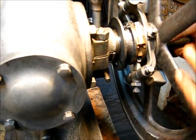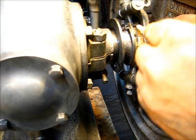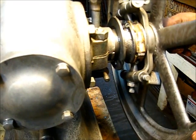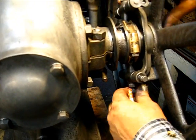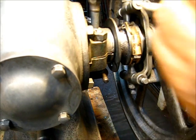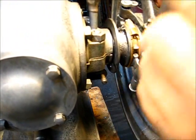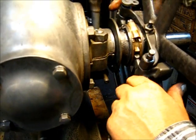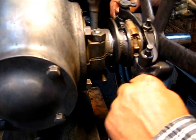What I was explaining a moment ago is the pin — that pin goes across in that brass thing in yonder. This is the direction the flywheel turns, right like this. That little pivot part of that flyweight — this turns backwards so that rides against that little arm right there. If this was turned around, that round thing would be on the back side and that arm would be digging into the brass part right there. Yeah, that works better than need be.